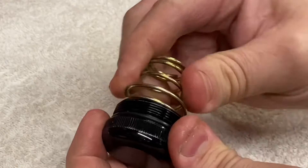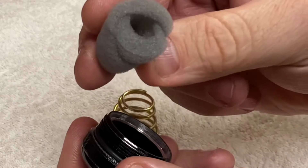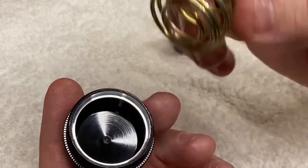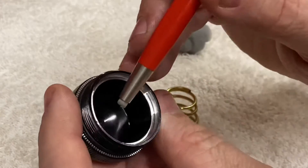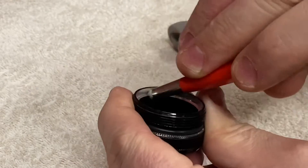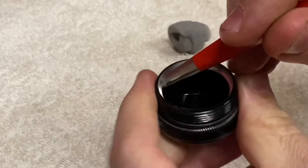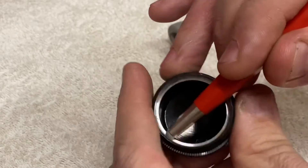Looking at the base, this has still got a spare bulb holder in, although the bulb is actually missing so it's obviously been used. But we need to make sure that spring makes a good contact. So again, exactly the same — use your fiberglass pencil, rub that round the inside just to take off any corrosion and shine the surface up. Then where the spring touches it will make a good contact onto that cap.